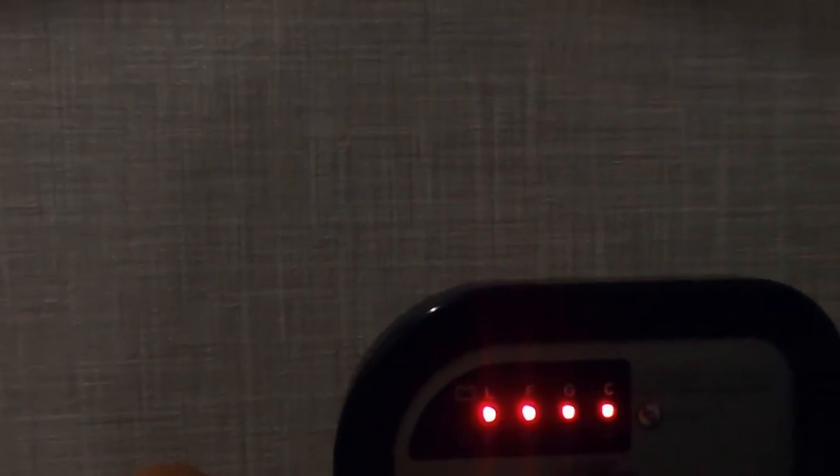Your fridge — open the top here. Over to the left you turn it on. Push that in for DC or AC and switch it to whichever one you want. Auto means when you're plugged in you're running off electricity, and as soon as you unplug it switches to gas. Down here you change the temperatures 1 through 5, with 5 being the coldest. Here's where you check your battery level, your fresh, gray, and black tanks.